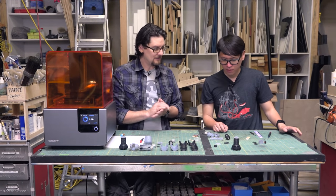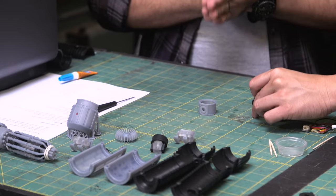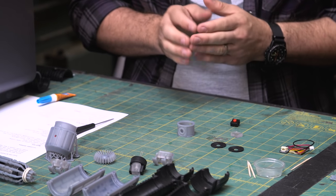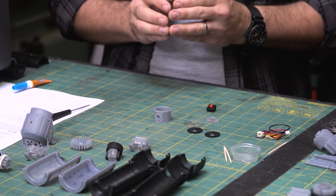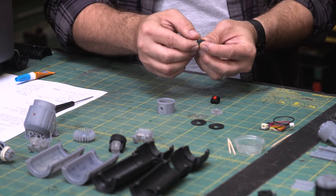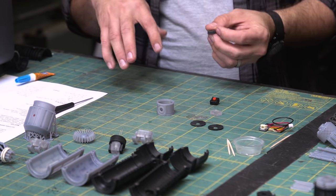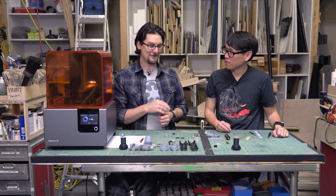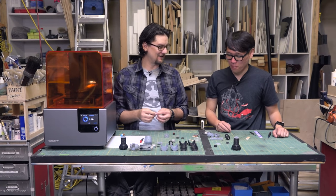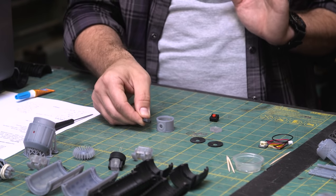All right. So then we get into the switch. Why don't you hand me that stuff right here? So I had to figure out a way to get a switch mechanism into this, and I also wanted to try to use the new flexible material to make an actual flexi button, which is a rubberized 3D print. This was a brand new formulation of this, so I designed this without knowing if it actually worked. We didn't know until like the week of Maker Faire, because we were rushing to get this done for Maker Faire. And I just printed the flex really thin and it worked great.